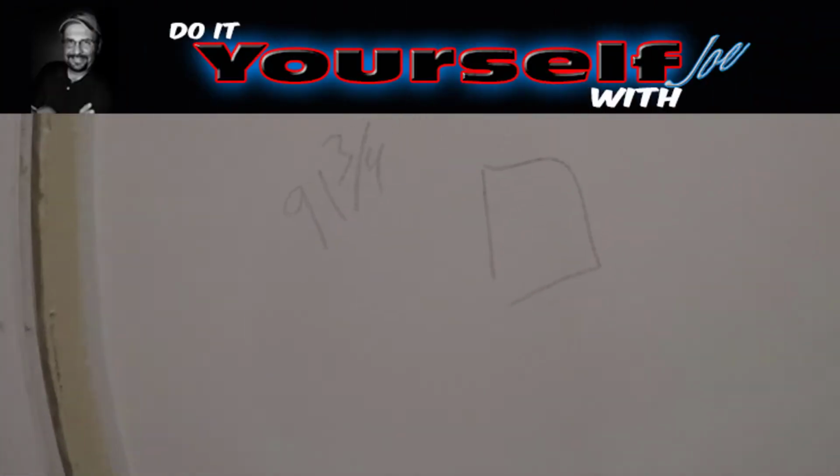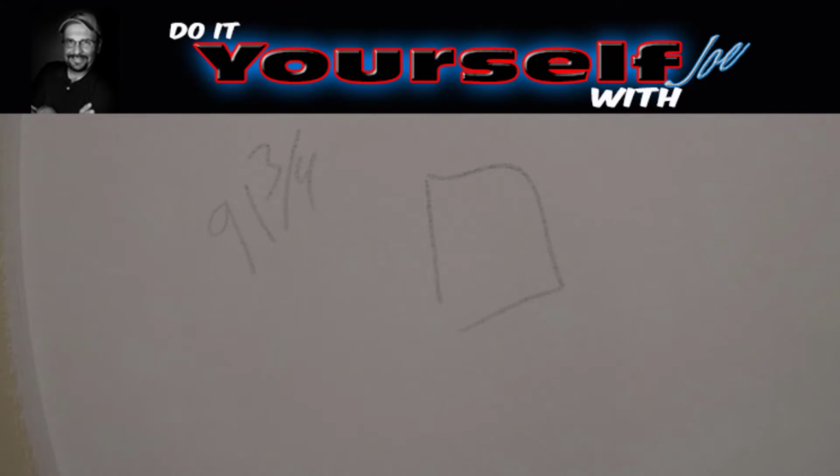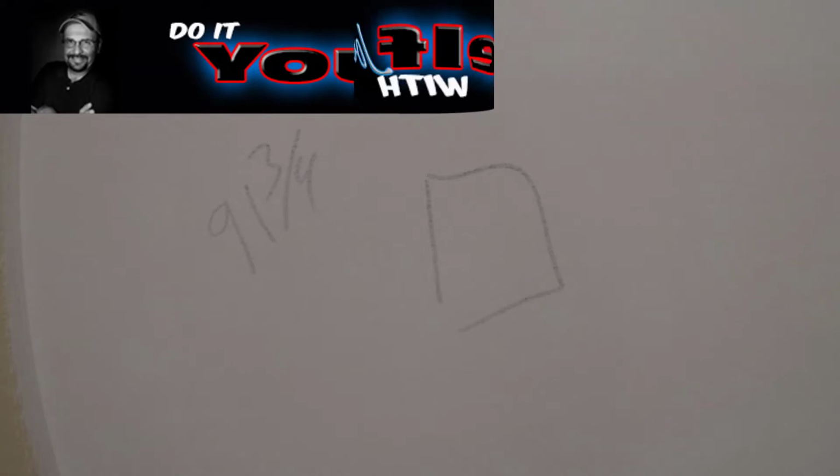In this video I'm going to show you how I get rid of marker stains before I paint. If you have marker stains on your walls, you'll have to seal them before you can paint. Even if you use a latex primer, the marker will bleed through the paint. Here I've primed with a coat of primer and you can see that it's bled through.